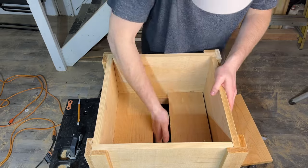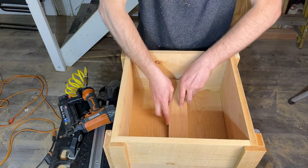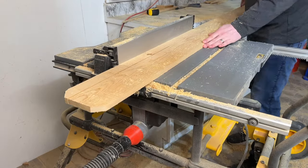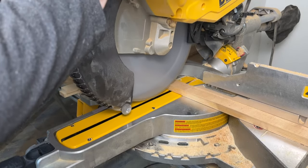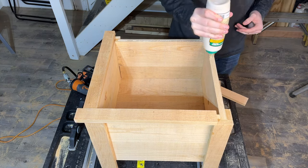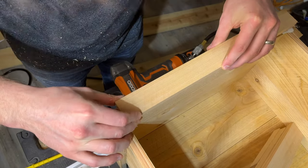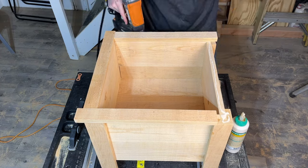Repeat this process with another 5-inch panel. There will still be a space left behind — this will be filled with the panel we set aside a while ago. Measure the proper width from the bottom, then cut to the proper size for a good fit. The final phase is to add the trim. This phase will use the half board we haven't touched yet. Clean up one edge of this board with a table saw and cut a strip at an inch and a half wide. We will need four pieces at a length of 14 and 7/8 inches to complete the trim — I recommend making another measuring stick for this since it's a tough measurement. After all those are cut, switch over to 1.5-inch brad nails. Glue and nail the trim from above. The long edge of the trim should be flush with the inside edge of the planter box, meaning the short edge of the trim is flush with the edge of the adjacent panel. Work your way around the top edge, gluing and nailing the trim down. The finished product will look something like this.